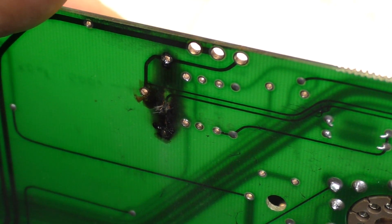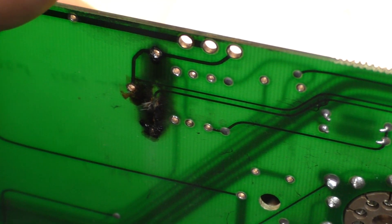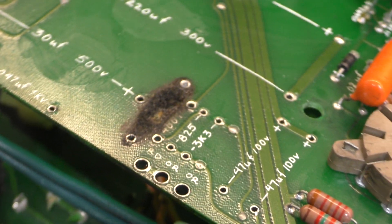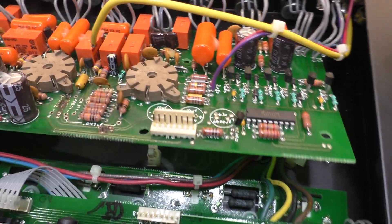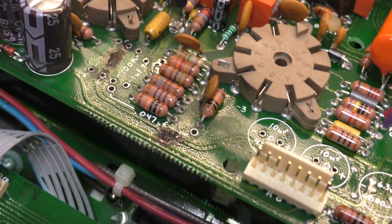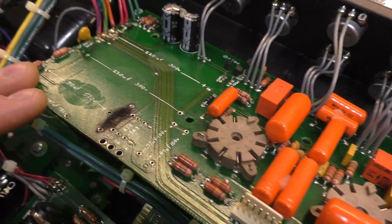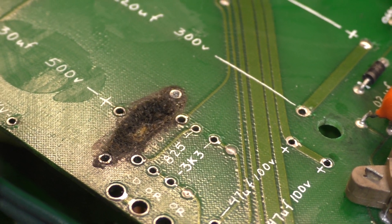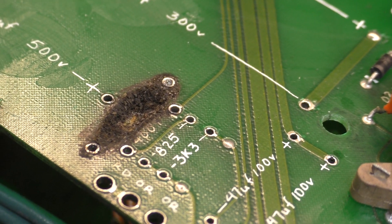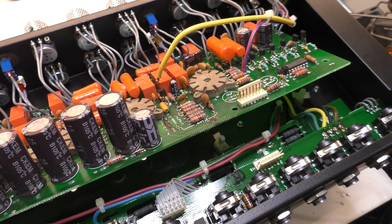We've just got to go through and see if we can cut out the damaged areas of the board. We'll need to come up with some fancy footwork in terms of mounting this stuff on the destructed board, because if we put high voltage in those areas it's probably going to start another arc within the board — the chemical makeup of the board is now so degraded it'll probably become conductive. We have to cut out every last trace of that stuff and mount components flying above the board, possibly point-to-point style. It's not that big an area, there's only a few compromised connections, so if we can cut out most of that and fly a few components in the air, secured properly with nice splicing, we might avoid major surgery.